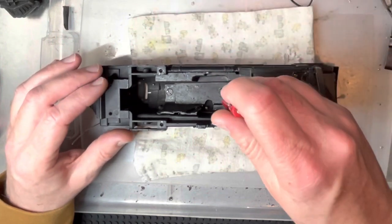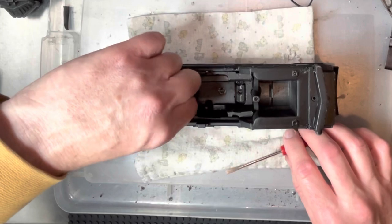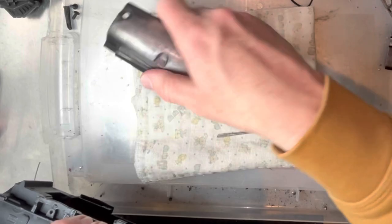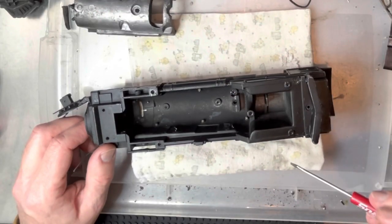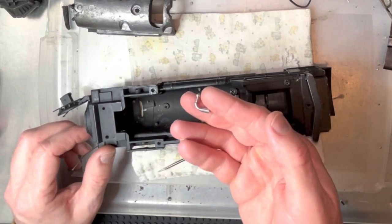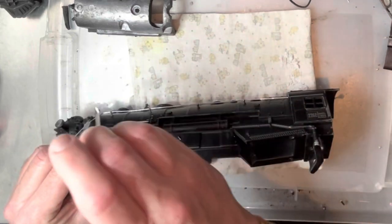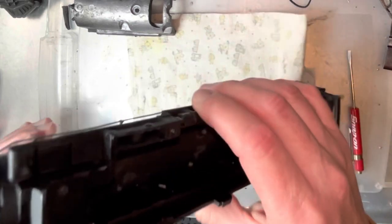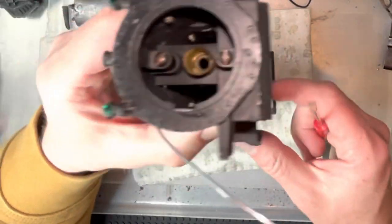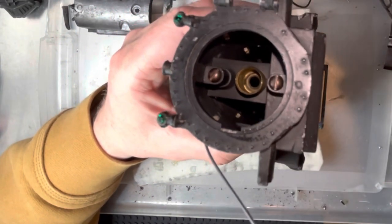The cool thing about this engine is there's a weight inside. You take these two screws out, flip it upside down and the weight will come out. Why would you remove that? Well, there are a couple of spots you can't get to with it in, like the nut for the whistle that sits on top and also for the metal pieces that hold the handrail, if you wanted to take those out. And if you want to take off the boiler front, you open it up and there are two screws — one here and one there — and then the boiler front comes off.